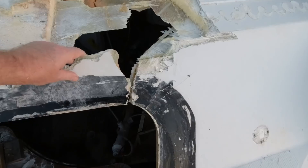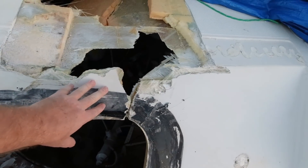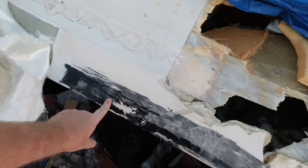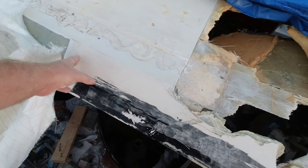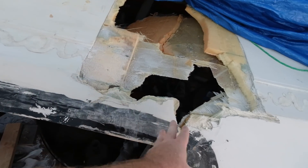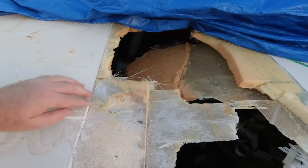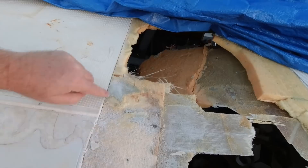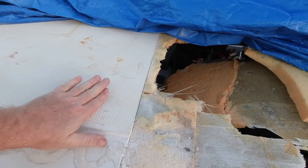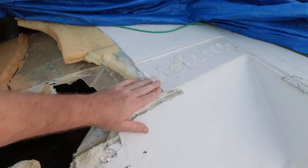So this is the next section I'm going to attack here. I'm going to cut this whole piece off now that I know it's aligned how I want it — probably back to over here where it's good. Then I'm going to grind all of the gel coat off and a couple layers down so that I can tie it all back together with the new core in there. I already started cutting this away back to the good glass, so this will have to still get feathered back, and then the new core put in and feathered back on this side.